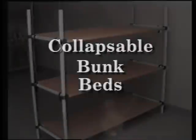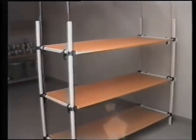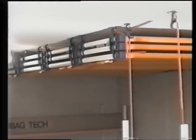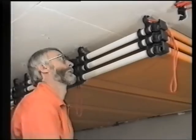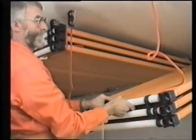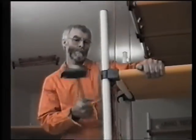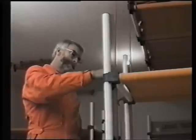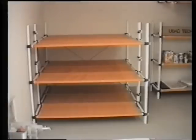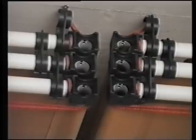For installations where it's not practicable to have bunk beds permanently erected and storage unassembled is not desired, we show a new concept allowing the beds to be assembled ready for use, whilst at the same time being stored on the ceiling, freeing the floor space beneath to be used on a day-to-day basis. When the beds are required, they're simply lowered from the ceiling and the four uprights inserted. The washable and fire-resistant polypropylene material which forms the base of the bed is supple enough for a mattress not to be required. The bunk bed frames are made from powder-coated steel tubes, with the connection pieces from POM polymer ensuring durability and long life.